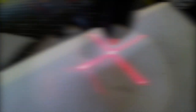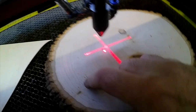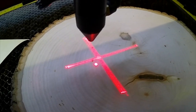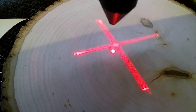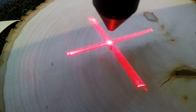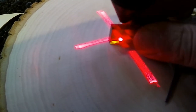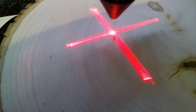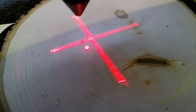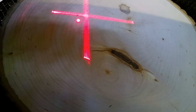And that dot's in the middle of that cross — my height is perfect. Now let's switch to this wood cookie I have. I don't know, three quarters of an inch. This stuff's three mil, standard three mil. So now I put my chunk in, crank my bed up so the point is in the middle — and bam, there's my height. Works perfect. Doesn't matter what I put in there, doesn't matter how it's in there. You've got two points of reference and you've got your height.